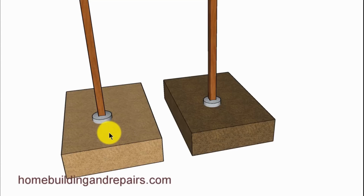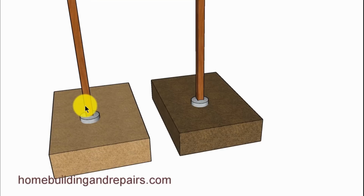Except, and this is another problem that I've had people say, hey, I'm just going to go ahead and put some gravel in. I'm just going to bury my wood fence post. Well, clay is going to be a little stronger to do something like that. If you just want to put the fence post in gravel, knock yourself out. In sand, there's a very good chance you're going to have to dig really deep, and my guess would be if you're going to be coming up 6 foot, you're going to want to go down at least 4 foot into the ground with the wood fence, because the sand is going to be looser and the fence during a high wind could actually blow over.